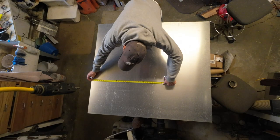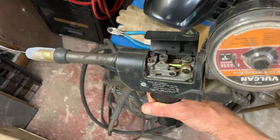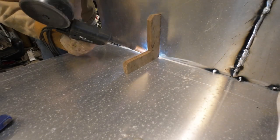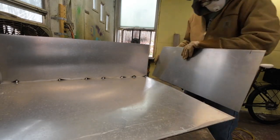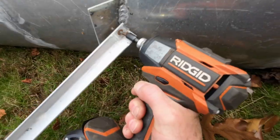If you don't have aluminum or the ability to weld it, you can make your truck bed out of steel or even wood. A lot of people are scared of working with aluminum, and I'm not going to say that it doesn't have its quirky qualities, but the nice thing about aluminum is that you can use the same tools that you cut wood to cut it.